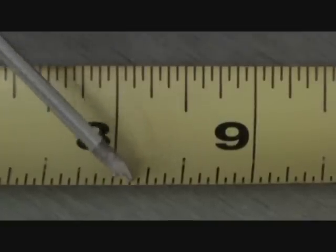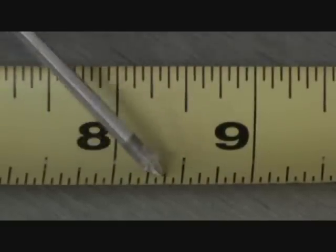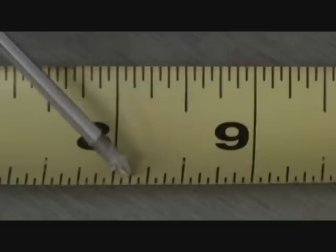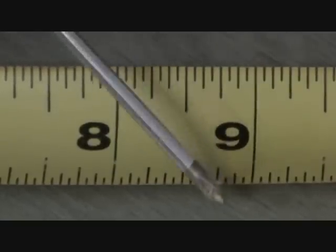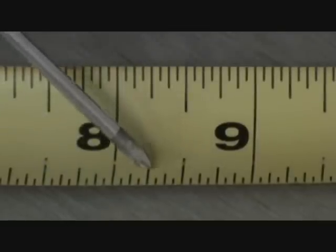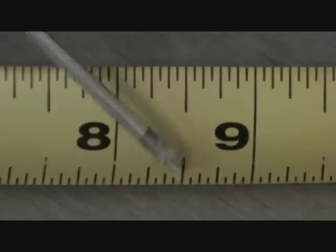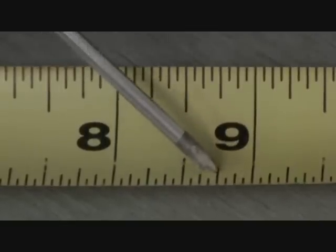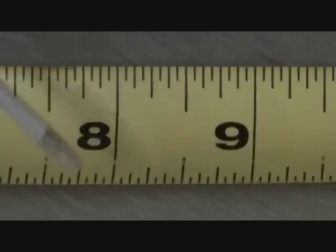Each one of these smaller lines, just a little bit longer than the sixteenth — this next line — you'd read those out as eighths. So on the tape, you've got one-eighth, three-eighths, five-eighths, seven-eighths. On the quarters, you'd read eight and a quarter, eight and three-quarters. This longer line here is halfway between eight and nine, so that's a half-inch. This is three-quarters of the way between an inch — so that's three-quarters. That's a quarter of the way between an inch, and that is read a quarter.